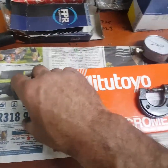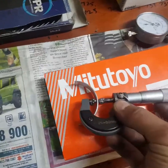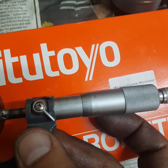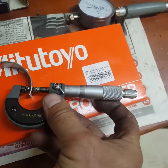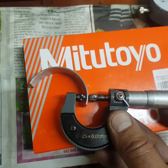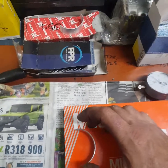So let's have a look at this other bearing. Once again, when you clamp this bearing you can see it's a little bit bigger — 151 — in the middle. And when you go to the side, it clamps on 150 and a little bit over. So this bearing is basically the same in the middle and on the sides.